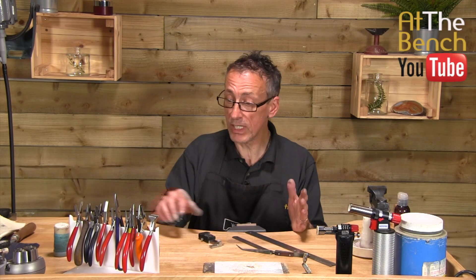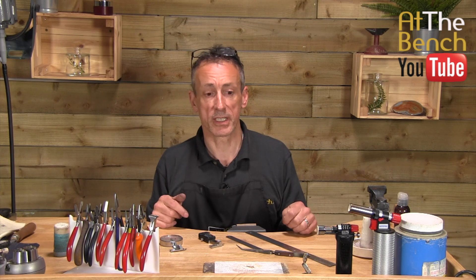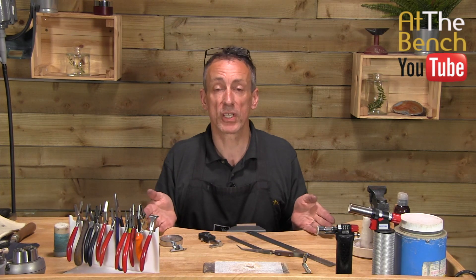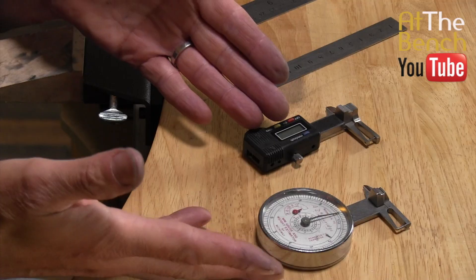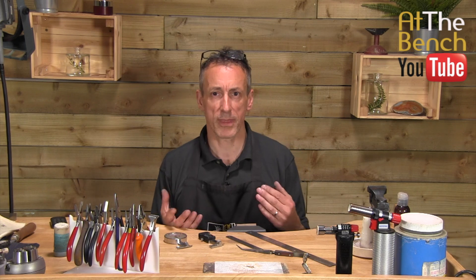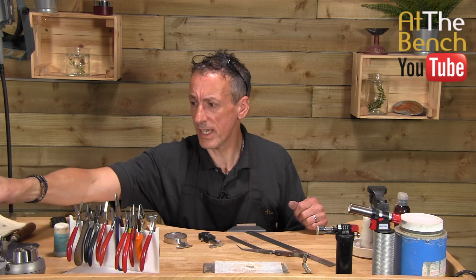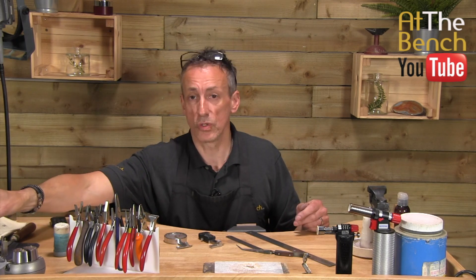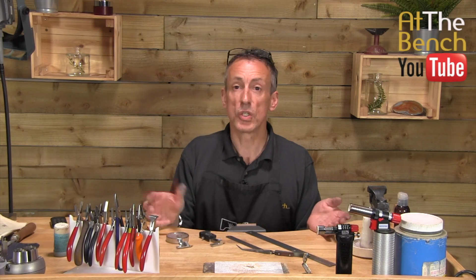You must remember to turn it off — really, really accurate and completely essential pieces of equipment when you're working at the bench. Rulers are ideal for working at rough lengths; perhaps you want to make a ring shank at 56.5mm — no problem. These precision tools are essential when you need accuracy, especially to make sure that claws are the right size, thickness, and length, that the hole opening is the right size, or to measure what size a drill bit in your holder actually is. Grab yourself either a small slide caliper — electronic or analogue — or one of these millimetre gauges. You won't go far wrong.